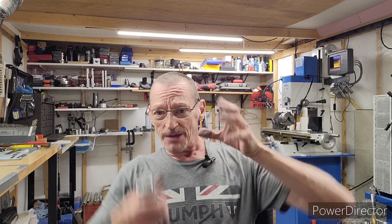Just hanging out and saving some more money to get a much higher end mill. They got a new, I think it's a new knee mill. It's a 739, I think it is. And I would love to have a small knee mill. I mean, that's just the way to go, period. The new small knee mill that they now have, the head moves in all directions on the X, Y, so you can tram it in perfectly just with the head. You don't have to go through the column like you do on these.